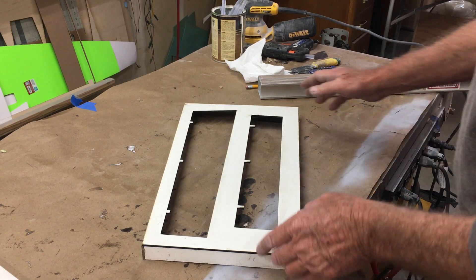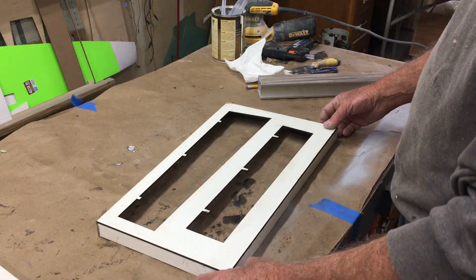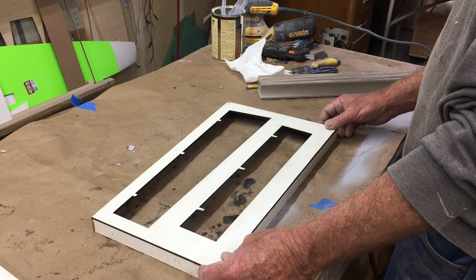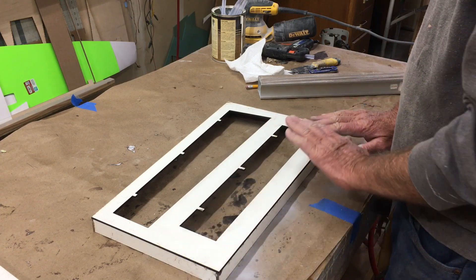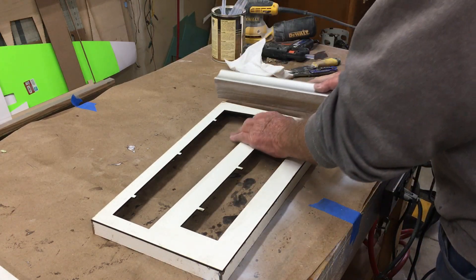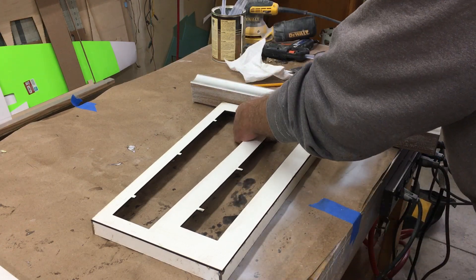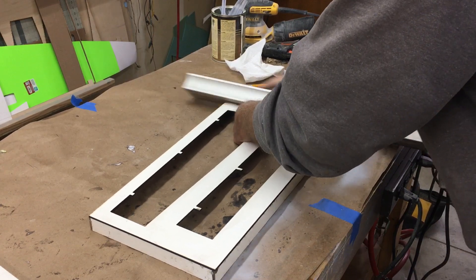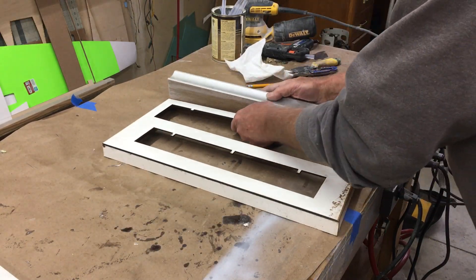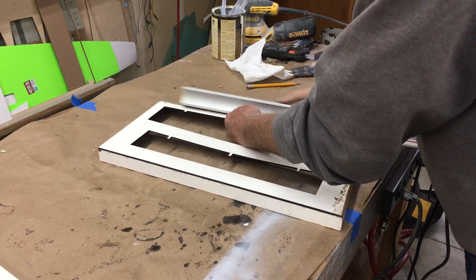Now that I've got the boxes made, I'm going to sand around the periphery of it, get it all nice and smooth, which will allow me to cut away the mold and make it nice and square at a later date. I decided even though I've got the parting planes made as a box mold, I've decided to go with a conventional flat mold — just don't need to really do it on this, and it makes it less flexible so harder to get the part out. I think I'm going to have problems getting the parts out, so I want it to be flexible — we'll just have a change of plan.